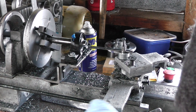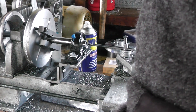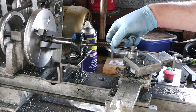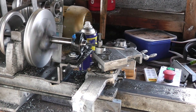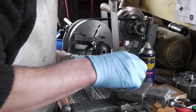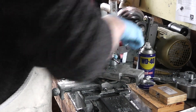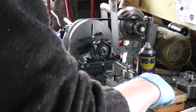I don't need to get the taper exactly right because I have a secret weapon. I do however need to get it vaguely on target. This is my secret weapon — a roughing reamer — and I also have a fine finishing reamer as well. I'm going to do a bit more boring because I didn't take out enough material. I know, I was shocked too. I'm getting roughly the taper I want; I just need to widen it out.